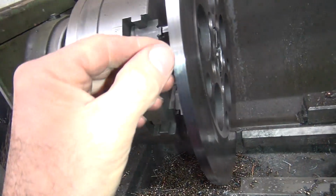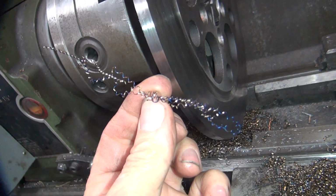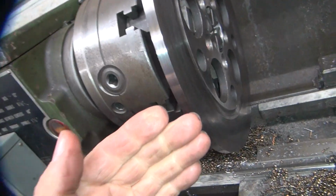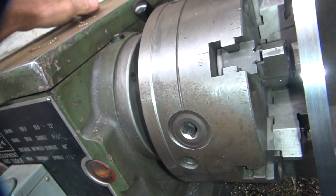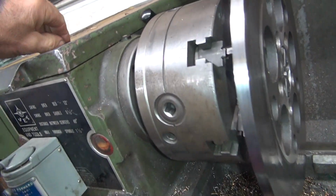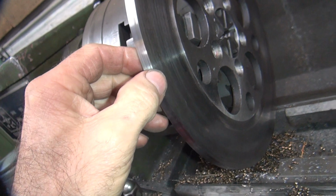What happened is it had the chip load. Chip load is the cutter getting a good chip going. You get a consistent chip pulling off all the way. It tends to cut more than when it's skipping back and forth, cutting and not cutting. So the first pass it didn't leave a real good finish. This time it left a better finish, so it cut more. So it kind of screwed it up. Oh well, that's the way it goes. Okay, now this is a very sharp edge here.